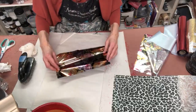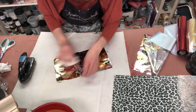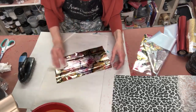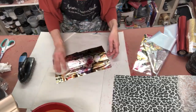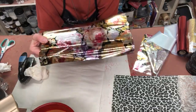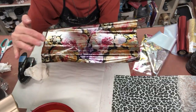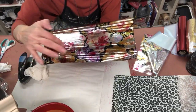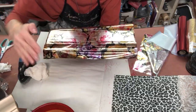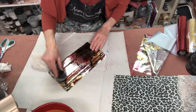This has a black background for us, which I think is going to be stunning with this particular print. Now, when you're doing something that has different levels to it, okay? So the molding goes in and out and in and out. The adhesive is going to grab on the high point, so there's nothing going to go down in this lower area to begin with because it grabbed the top first. So we'll have to lay a fresh piece down in there.